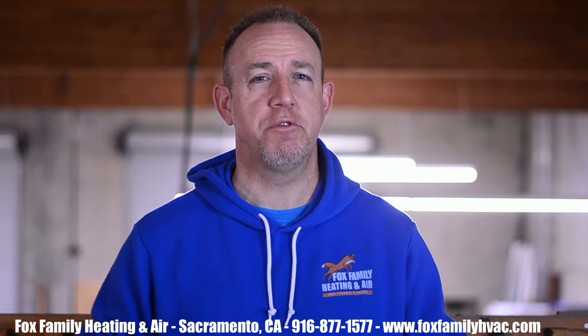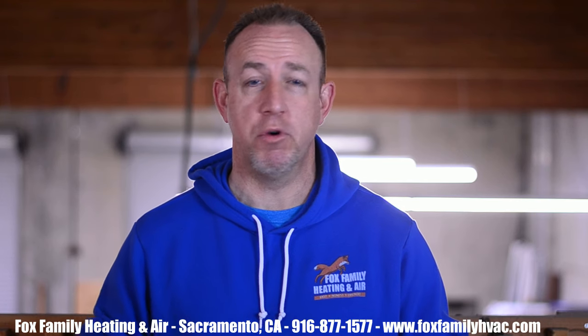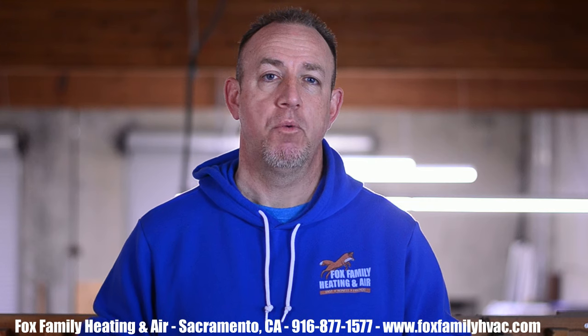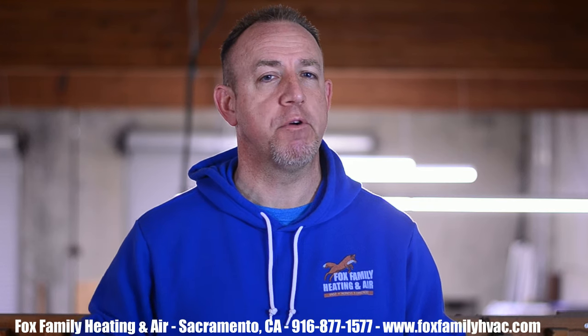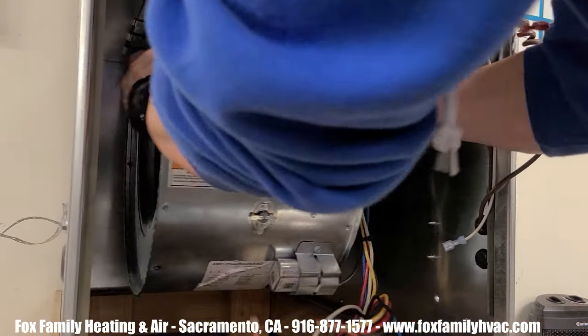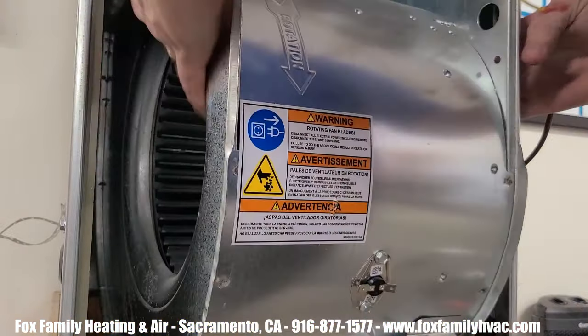If the rotor that holds the fan blower wheel won't spin or is hard to spin, it's a good sign that the blower motor is shot. Once again, if the blower is getting proper voltage and the capacitor is good, but the blower won't freely spin, it may have seized, which is not uncommon.